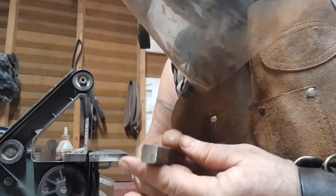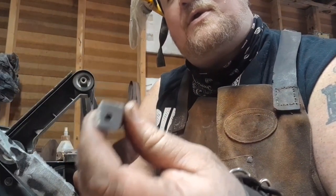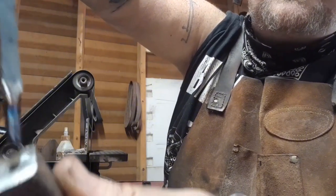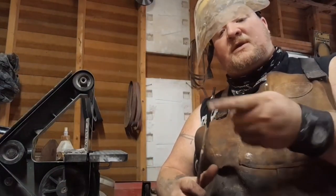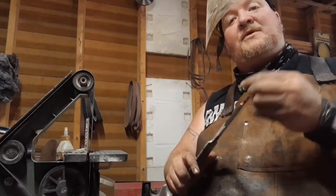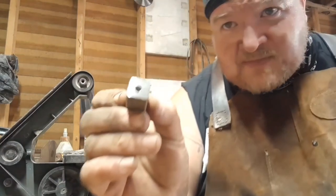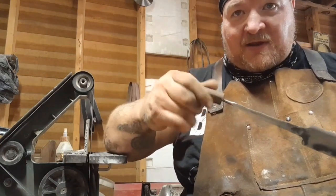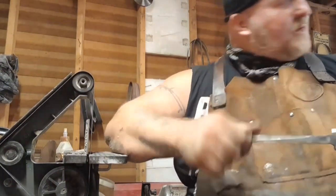We got this nice and flat so it can be drilled and tapped and ready to sit on. We've taken this over to the drill press, drilled a hole in it. It's a little bit bigger than the hole but that's fine because we're going to thread both pieces so they'll fit together nicely. I got a little caught up and forgot the camera, but as you can see I've threaded the end of the tang and the butt cap here so it screws right into place. That'll hold everything together while the epoxy dries.